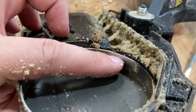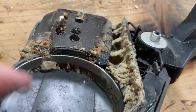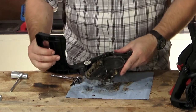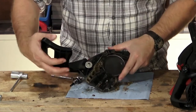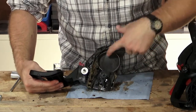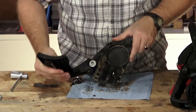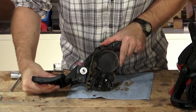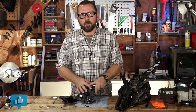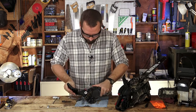I haven't used the chain brake at all but you can just see the burnt area in the steel where it's catching too much. In case you're wondering how the chain brake works — basically if this thing were to engage, it suddenly gets tighter and tightens around the pulley so it stops the chainsaw from spinning. It engages and gets tighter, and it doesn't need to lose a lot of clearance to really tighten up on the pulley.